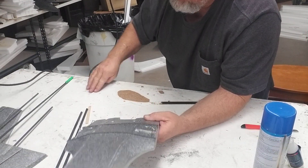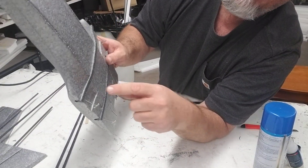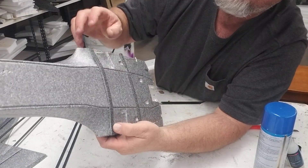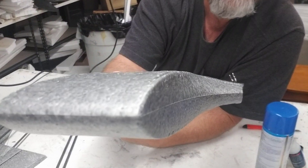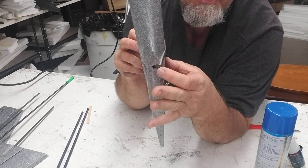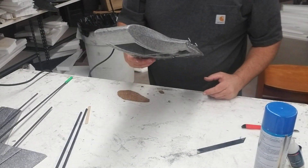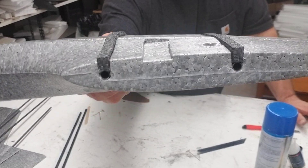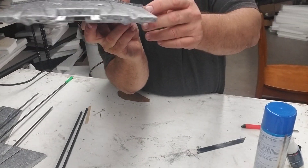When I put the caps on, I put a little dab of goop on top of the spar before putting the cap on, then pinned this in place. So I only have a little bit of goop at each end on top of the sleeve where they touch, and I left them exposed up above just a little bit. They're pinned with goop drying on the inside overnight. Now I'm going to pull these pins off — the front and rear sleeves are left up so we can trim them flush.